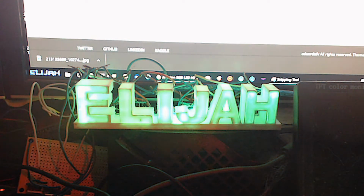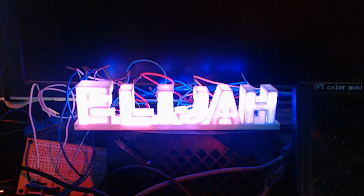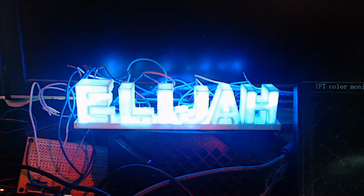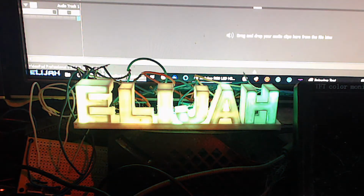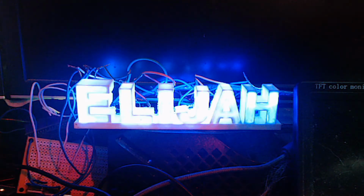And since we're using one resistor on each cathode for each LED, and we're using so many LEDs, when I went to cross over, like say when you have a red anode in parallel with a green anode, or a blue anode in parallel with a red anode, then the red anode's always going to take precedence. So we had some weird colors, and blue and green faded out, which means the blue and the green would no longer work. It would have been really cool for the idea that I had, but without putting a separate resistor on each anode, and then we wouldn't need it on the cathode, obviously, we would not be able to get those brilliant reds, greens, and blues.